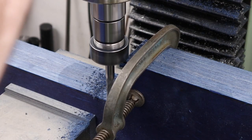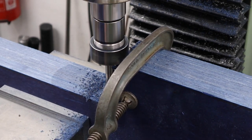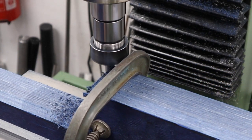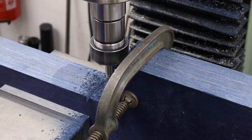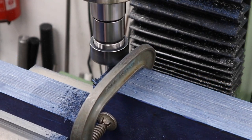The other way to square up the grip would have been to flip the stock on its side and go through the laminates rather than past them. That would have stopped them busting out and still given us a nice square finish, and I may do that at a later date if I need to walk the face of the grip back a little.